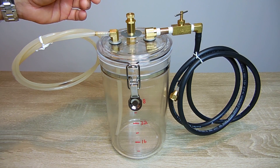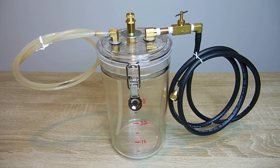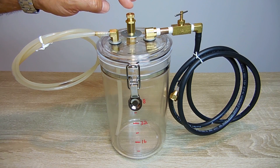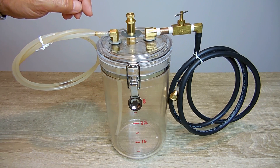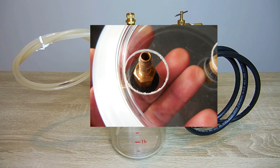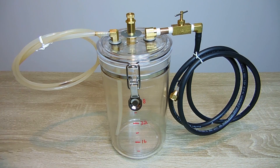The valve — I'll place a link in the video description to make it easy for you to find it. But the rest of this stuff is very simple — any hardware store will have it: Lowe's, Home Depot, Ace, True Value, or you can purchase it online. This side is quarter-inch male pipe thread. The washer slides over the thread, giving it a nice base when you bolt this down and helps distribute the pressure on the plastic lid. Just beneath this is a black rubber washer. You're going to wrap Teflon tape — you can see the white around all the male pipe threads.